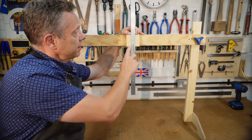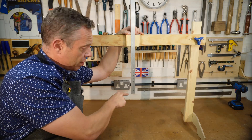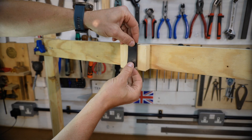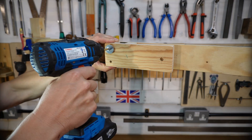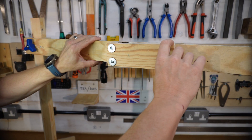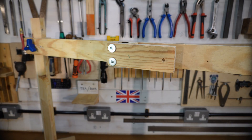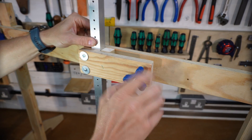The next part is to make the clamp that lets me adjust the arm holding the camera at the bottom. I fitted a rubber pad to the back of the slot that holds the camera arm, then screwed a block across the front of the slot, checking that the fit was loose. This block acts as a clamp, pressing the metal bar tightly against the rubber pad.